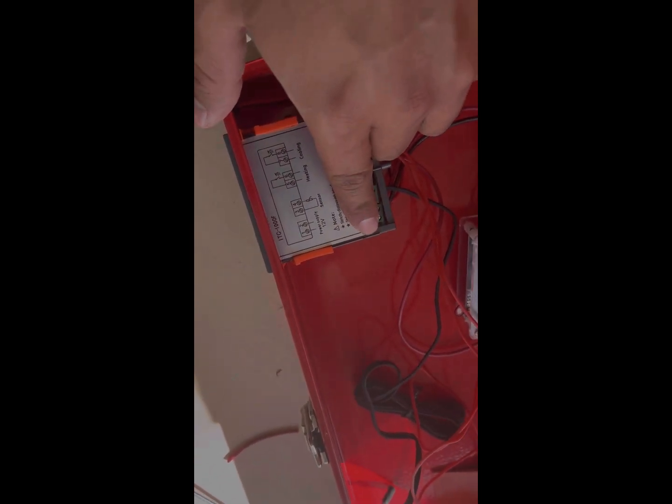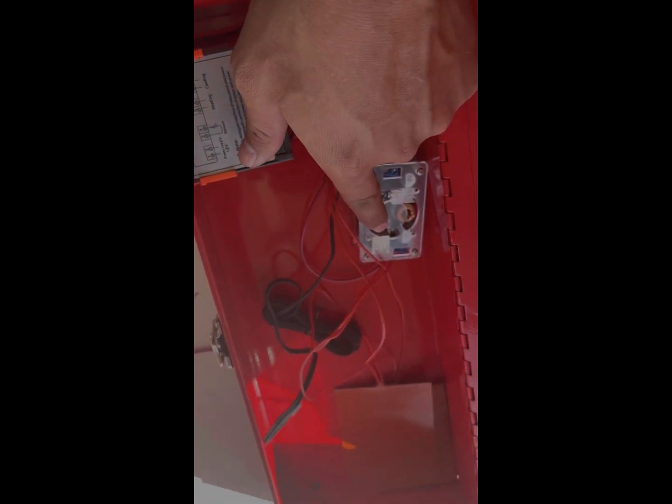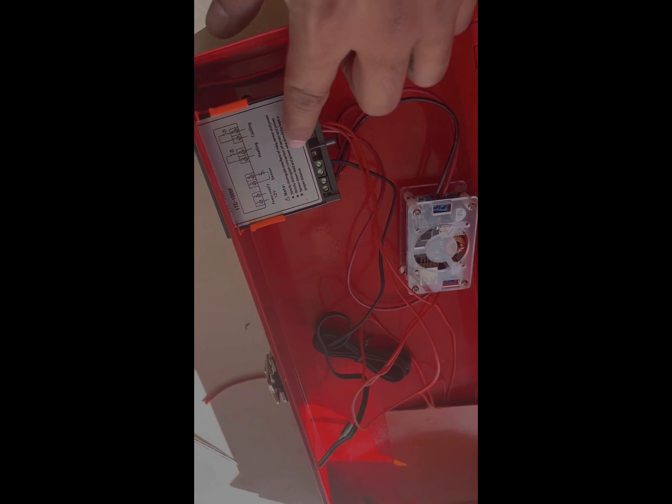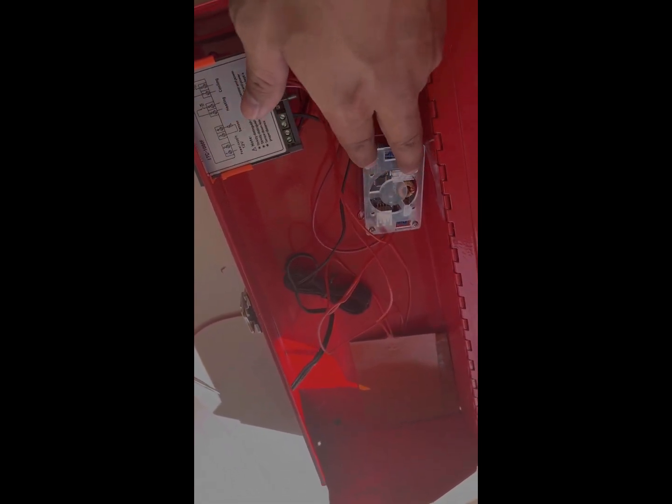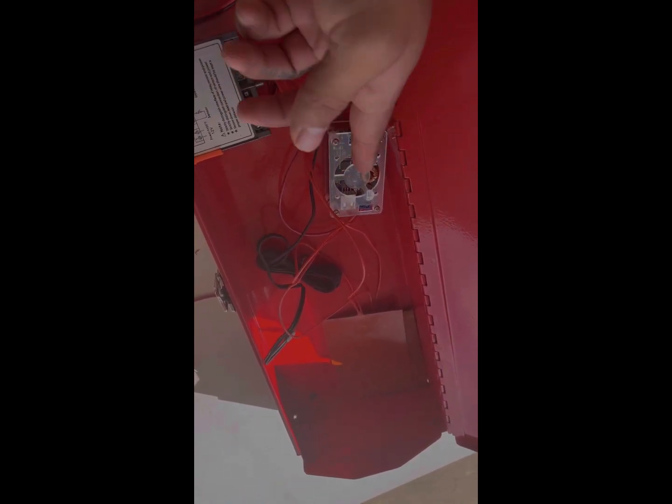Before I make this all pretty, I just wanted to show you the wiring. I've got my controller with 12 volts from my battery coming to pins 1 and 2, a jumper from there to the buck converter — bringing 12 volts to both. On the secondary side, the neutral goes to one side of each heating pad. The other side goes straight to the heating switch, and from there to the other side of the heating pads. We adjust the current via the buck converter, reducing from 12 volts down to about 8 or 9 volts. The sensor goes to pins 3 and 4. Now I'm going to make it a little prettier and cut the foam.